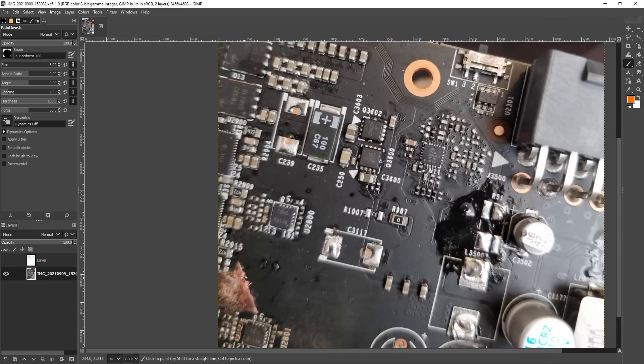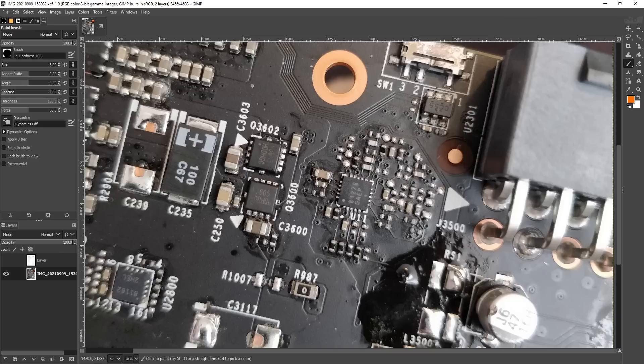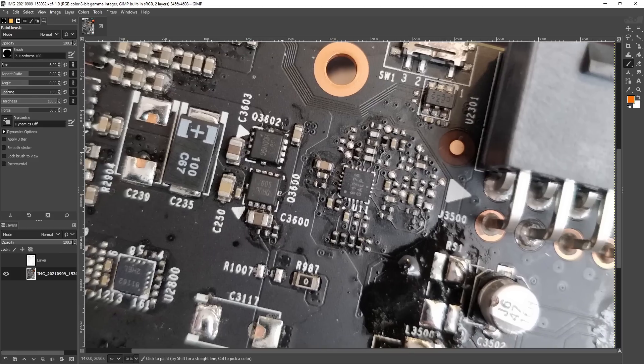Which is why I have a 1080 FTW - yes, the card works. We will probably have a video soon about it. I did a livestream with that card. On that card I modded the memory voltage because GDDR5X scales with memory voltage, so you want to be able to raise the memory voltage on these cards.